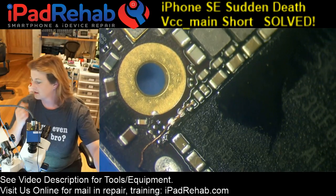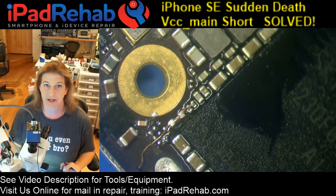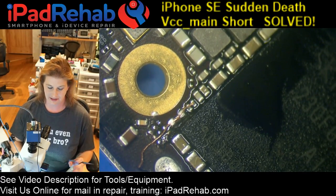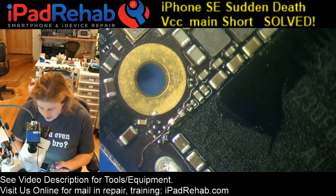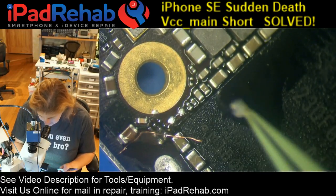and so right now, guys, instead of putting back the MOSFET, which is long gone, I'm just going to solder a wire to connect battery and VCC main, which is basically doing the job of this MOSFET for it, since it is long gone.